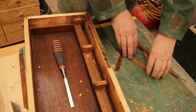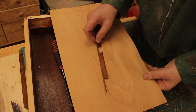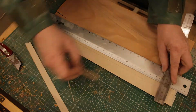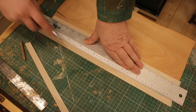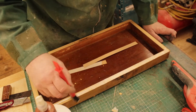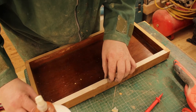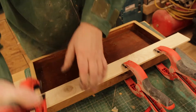Actually some of the edge is missing off even these smaller pieces. So I'll try to find a small piece of veneer that's quite close. It's easy to put masking tape on first — it will stop the veneer from splitting when you cut it. The strips are oversized because it's easy enough to trim them down when it's all dried. Because the strips weren't long enough, I decided to join them in the middle rather than put a little piece on the end.